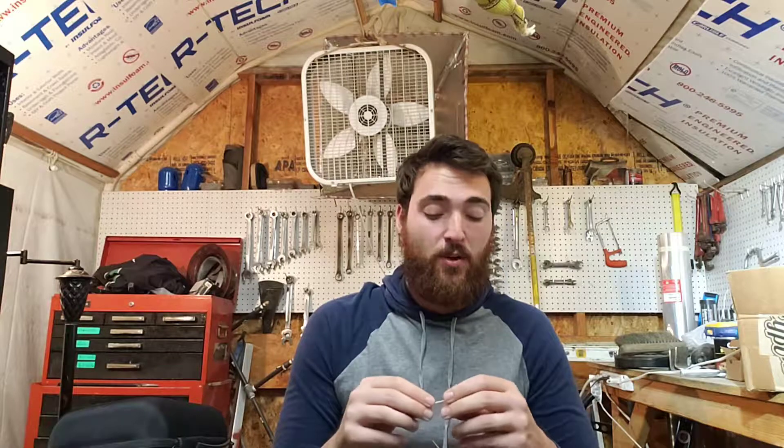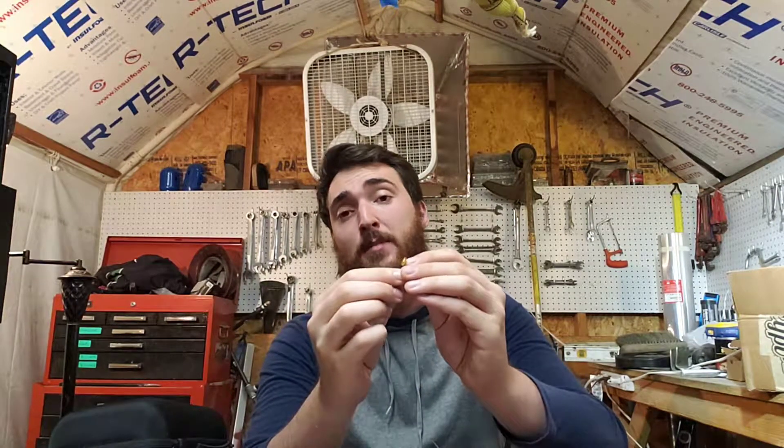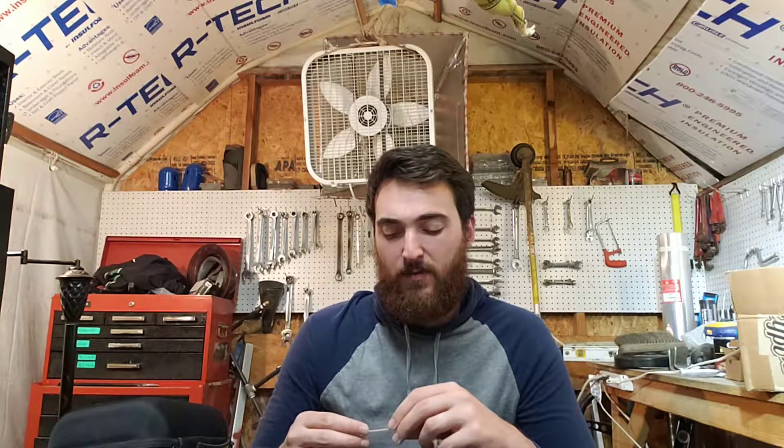I hope you found that information useful. One other bit of information before you go: I did manage to break the Axie 2 antenna — however, I didn't actually break the antenna itself, I pulled apart the MMCX. The fit into the VTX was crazy tight, which I do feel is a good thing for performance, but when I went to pull it out after swapping it probably about 10–15 times, a little piece was left behind in the VTX. I had to pull that out with a set of pliers and press it back into the antenna. After that I was not using this antenna for testing anymore, given that it was probably damaged in some way, though it does still seem to be working fine.